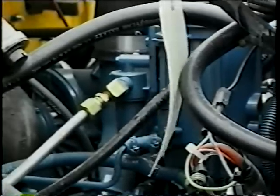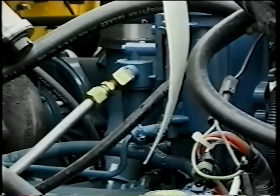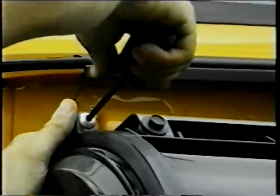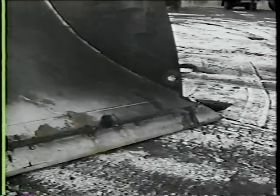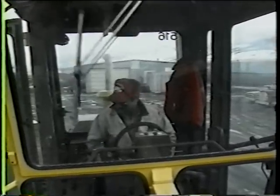Check the fuel filter. If the fuel tank was left less than full overnight in cold weather, the possibility exists that condensation formed in the tank. The air filter will have to do extra duty with blowing snow, so make sure it is okay. If you have a rotary type pre-cleaner, check to see that the spinner is free. The cutting edges of the grader mold board, the plow, and the wing should be checked for cracks. Snow, and especially ice, can be very abrasive, wearing down cutting edges a lot faster than you might think. Visibility is going to be dependent on the good operation of your defroster and cab fan, along with the windshield wipers. Your job will be much easier if you can see clearly.